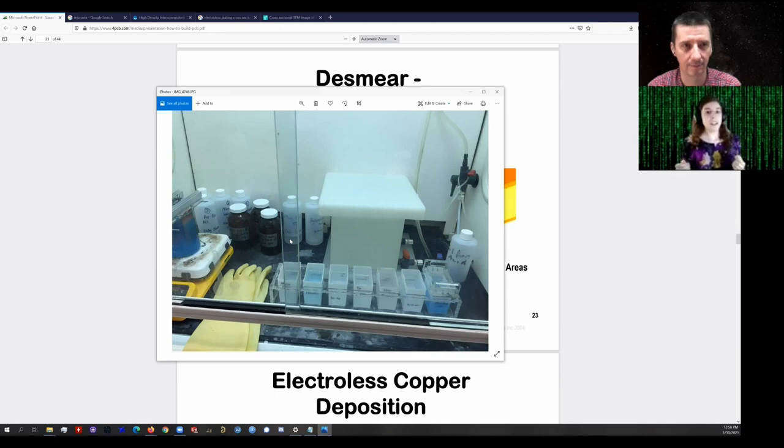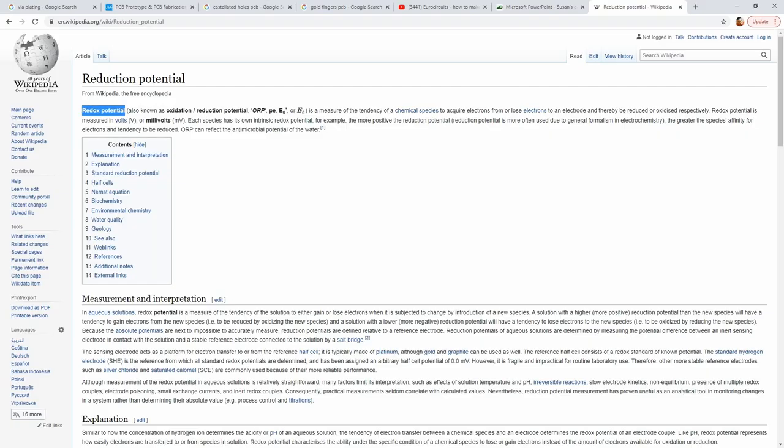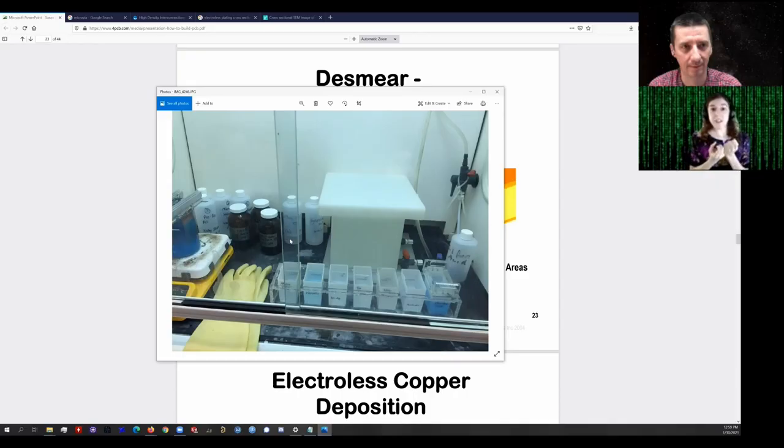Silver, when it's a nice polished surface, is a lustrous silver color. But silver in the form of nanoparticles is very dull gray. So the board, in this step, within seconds starts to turn gray — especially in the holes where the tin is. Silver has a higher redox potential than tin. You've probably seen this with simple experiments, like putting an iron nail into a solution of copper sulfate — copper has a higher redox potential and just deposits on the surface of the nail. That kind of reaction occurs simply because of a difference in redox potential. Suffice it to say, silver will rip electrons off of tin: two Ag+ will each pull an electron from Sn2+ to yield Sn4+. The tin is still there, but now you have all this gray silver.